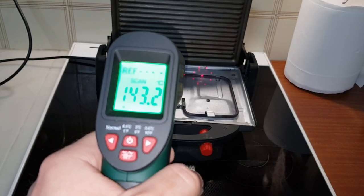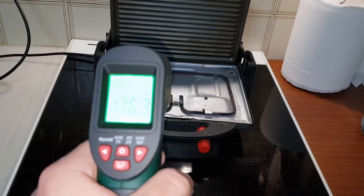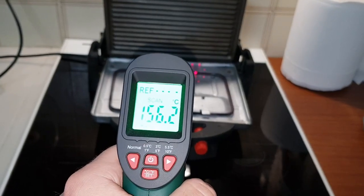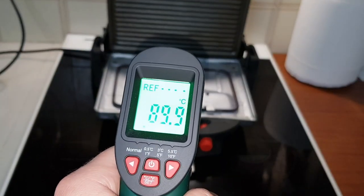As the electric current passes through the resistor, electrons face a resistance, which ultimately causes the release of heat energy, a process commonly known as Joule heating. This phenomenon is responsible for the increase in temperature observed on the toaster's plate. The shape of the resistor is best seen on the uncovered part of the toaster.